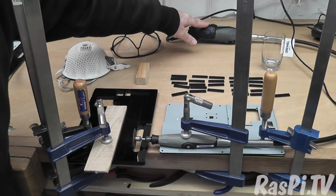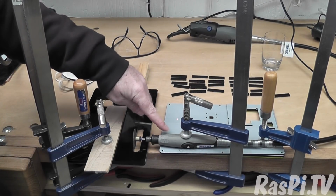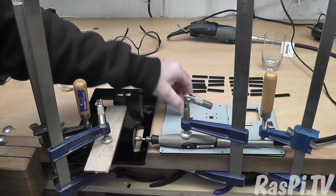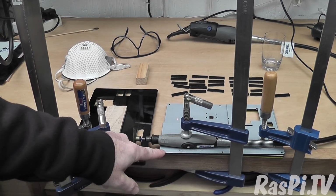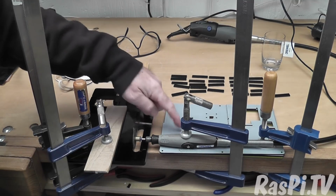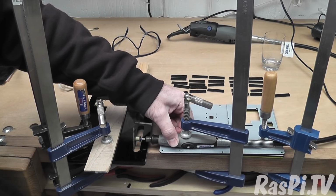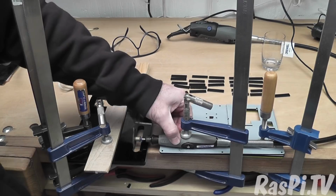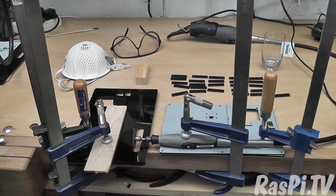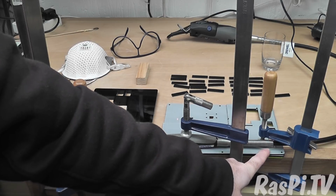So we've got the Dremel here and the flexible adapter that enables me to clamp it to a couple of bits of perspex. They're actually the back of an old screen case from a project I was once involved with. There's a slot in these which is exactly the same size as this slot here, which enables this to be clamped effectively, but not too hard to squash it and stop it rotating. You have to get that just right, because you really want to hold that in place securely. And another clamp is holding the perspex plates in place on the bench.